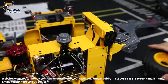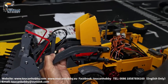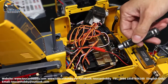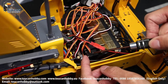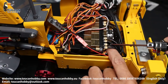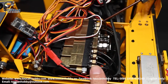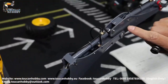I will turn it around so we can see the upper part of the distribution valve and how it works. We have five distribution valve blocks and five servos. For valve number one — the upper part, this one line, is one direction. The upper part oil flow goes to the rear side, the digger control.